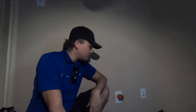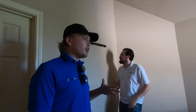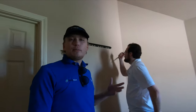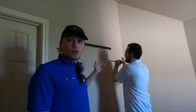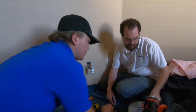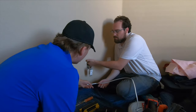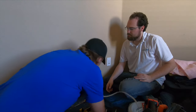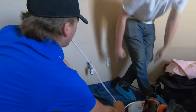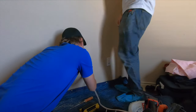Now what we're going to do is cut a hole up top, tap off this power outlet down here, shoot some Romex up the wall, and put in a new outlet. Sam's cutting his drywall template — gives you a little guideline on where to cut so you don't mess up. Now he's going to use his drywall saw to cut a hole up here and we're going to fish the line up. We're going to shoot our Romex up the wall — it's about five feet up, so we think we can do it without a fish rod since there's no insulation. You just try to make it super straight so when you shoot it up it doesn't get all tangled in the wall.